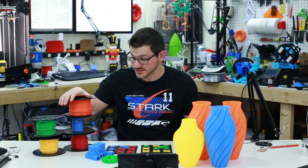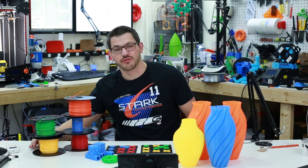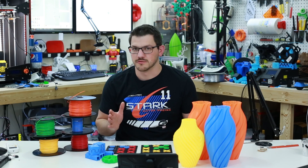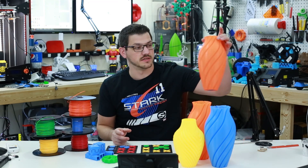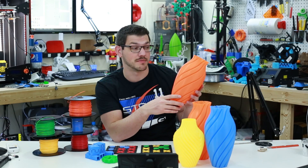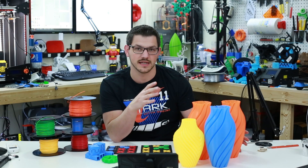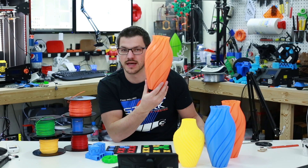As you can see, leftover the rolls — not much left. Blue is practically gone, red is mostly there. I used about half the roll of the green, getting on half the roll of the yellow, and a good third of the roll of the orange. I did print a lot of things and used a lot of this filament for some other testing. This blue and these two orange vases are the Make Anything vase and they came out beautifully. I printed these on the Triangle Labs D-Force Mini using a smoothie board, which I am learning how to calibrate. There is something you get out of smoothie boards with the DRV 8825 drivers called Salmon Skin, and this one right here showcases that.